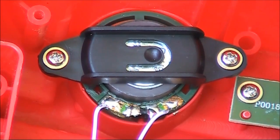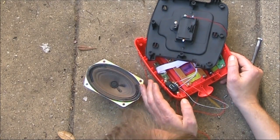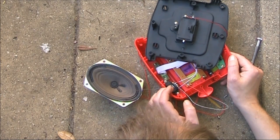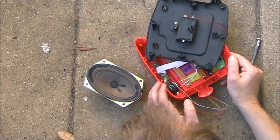Here's the speaker — potentially useful for QRP portable homebrew gear. It's a good backup to have in case you leave your headphones at home, and you should be able to fit it into most QRP rigs. Bigger speakers are more efficient and should give a bit more sound, especially compared with the micro speakers you find in toys. Here I've connected it straight in parallel with the existing small speaker.